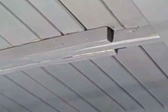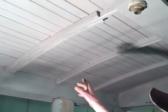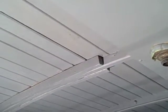And then right here is a rotted rib. Apparently the roof leaked and water got down into that rib and eventually weakened it. So at some point, and I don't know whether this was Seashore or whether it was the York Utilities Company, they put what we call a Dutchman on either side of the rib and stiffened it up. We decided to leave it there, partly because it was so hard to get off and partly because it was part of the car's history. And we put a lot of epoxy on the upper side of it so that it's quite solid now.